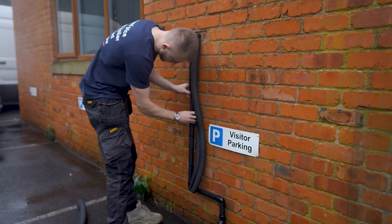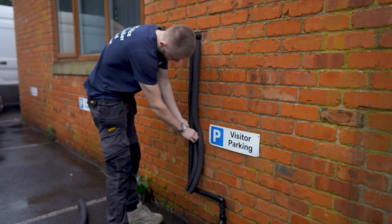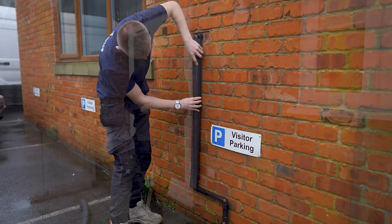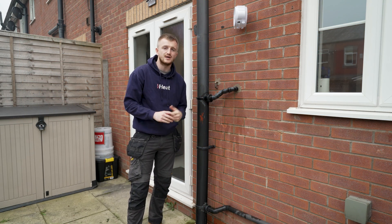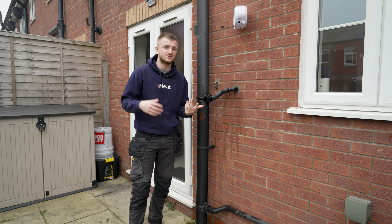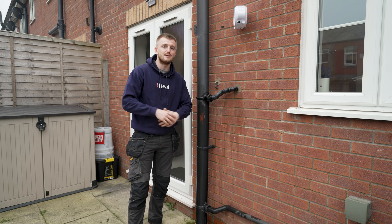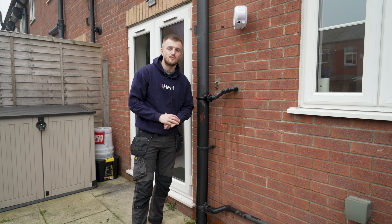Finally, you want to pick up some lagging — this is it from last year, really nice thick high-quality lagging which can go around the pipe nice and easy and snug, zip-tied nice and tight. This will protect it from freezing in the future, acting as a layer of insulation, but also protecting it from animals like rats or mice which may be nibbling on your pipes and causing leakage. If your pipe is high up like mine, I don't think that's something you have to worry about.